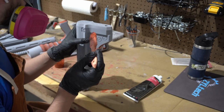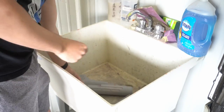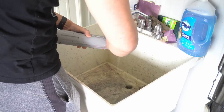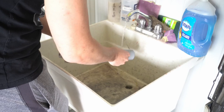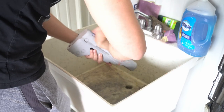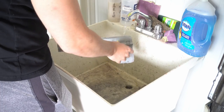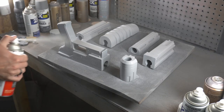Just one layer should really do it. These support areas are a lot better than our usual printers like the Creality CR10, so one layer of Bondo, hit that with a 200 grit sand, and you should be ready to go. Usually it takes us a couple of days to get to this point, but with the Bambu prints we got here in a day or two including the wait time. Now we're wet sanding — this wet sand gives a super smooth finish, turning the surface from a paper texture to pretty much a glass-like smoothness.